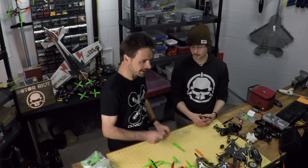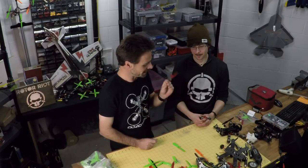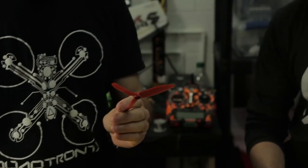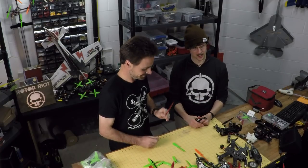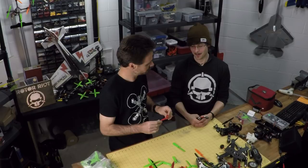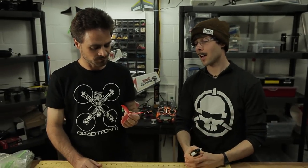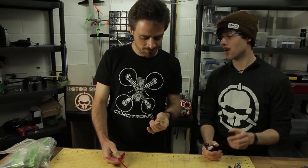There's another way to go by adding blades — you've got a three-blade prop. This has become a pretty common and popular prop, mainly through Steele's flying. I hated it at first — I did not want to like it. I started flying tri-blades at Drone Nationals. I was stuck on the 5x4 forever and hated the thought of going to a tri-blade, simply because I was going to lose a prop 30% more often. But I threw that prop on there and was blown away by how locked in it felt, how planted it was in the corners. You're increasing the surface area and also the disc-like space within the air that you're flying in.